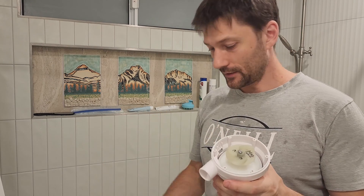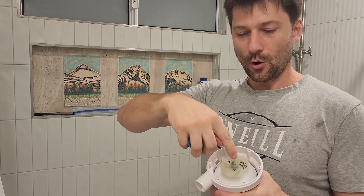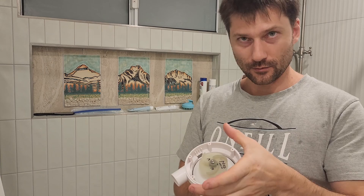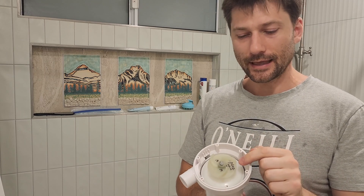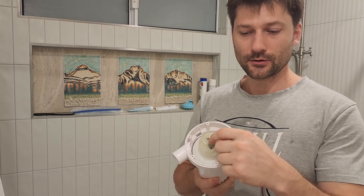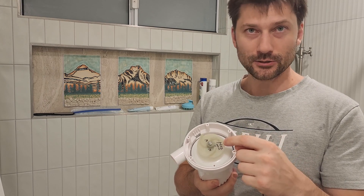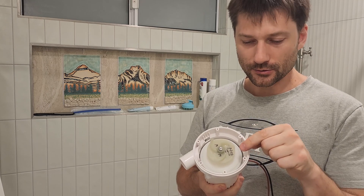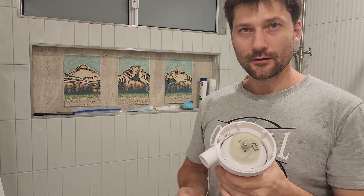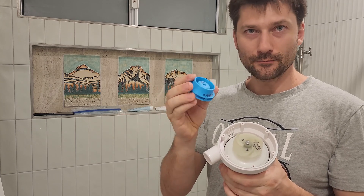This is the stock impeller on this pump and it is an open face — basically that means it just presses up against the piece of plastic that goes over the top. There's a little gap between the impeller and that plastic. Right in the middle there's a low pressure zone, and right at the edge is the high pressure zone. That high pressure water is going to try to follow that gap back to the middle and you get a recirculating effect.